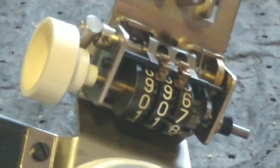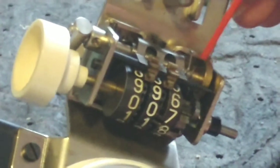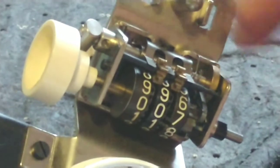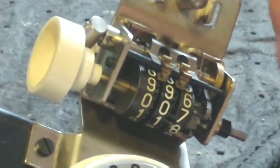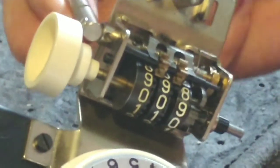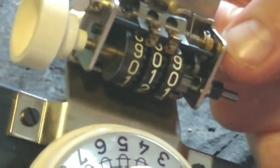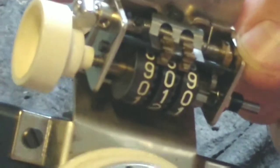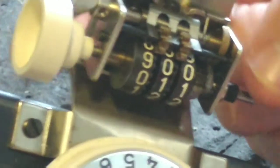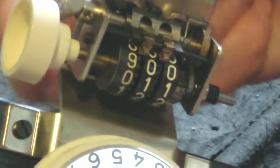Okay. You will notice there's a brass wheel. We see it, yeah. Portion here, and this is steel. And any time you have two different metals, they're going to get a little oxidation that makes them tend to want to stick. But you see, there's our movement. So this brass piece where my thumbnail is, is actually a stop cam. It's got a cutaway that when it gets to this upper position, stops the spring from working.